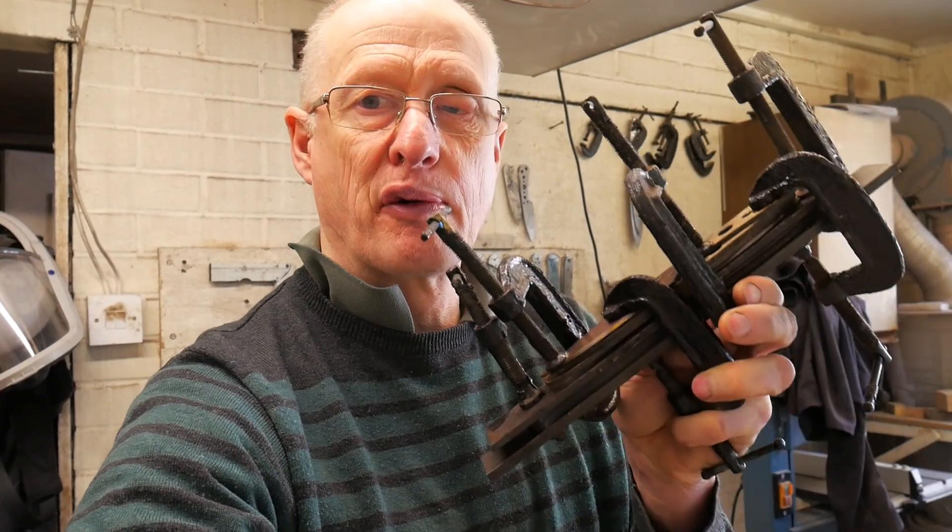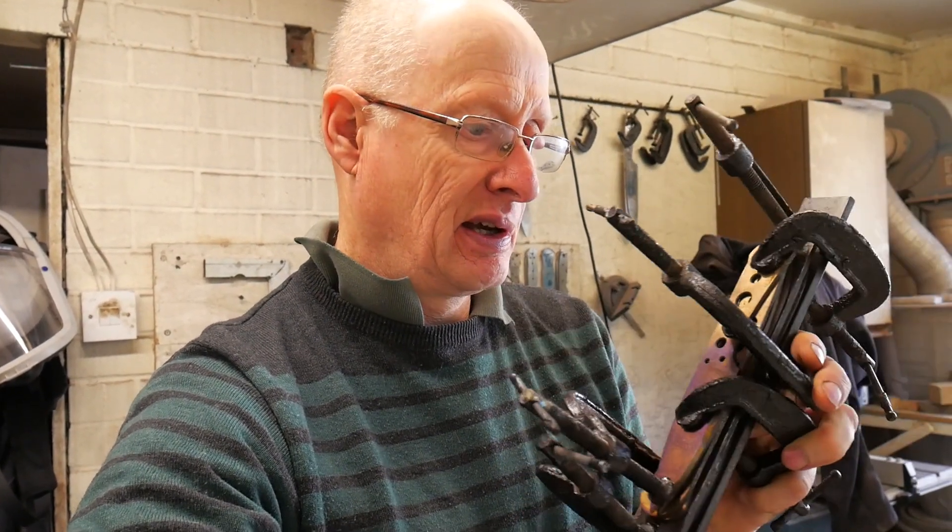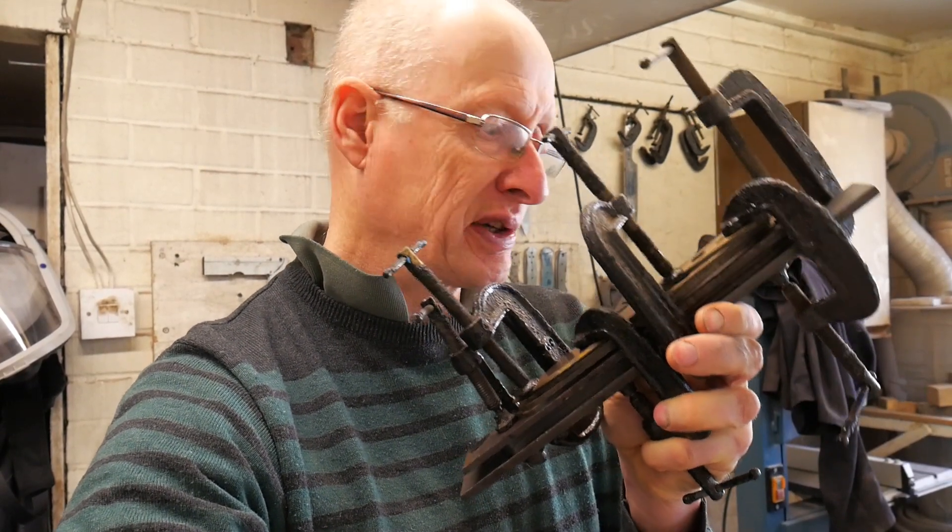It's a new day and I've finished the temper cycles with the knives, now all clamped up. The first two temper cycles are two hours each, and the knives are always clamped up at that point. Up to now they've only had one Rockwell reading taken — that was after the quench — and they came out around about 65.5 to 66 HRC, which is basically about as hard as you'll ever get O1 steel to go.